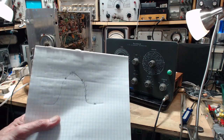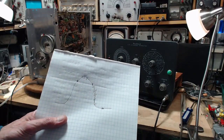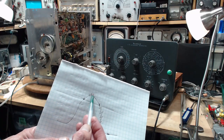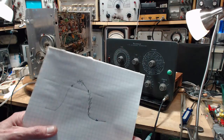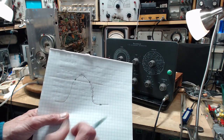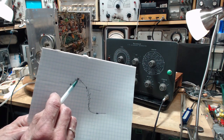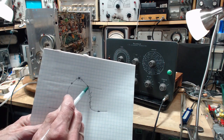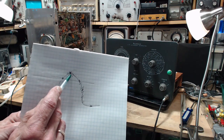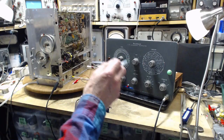I tried to put a marker there, knowing that this guy has a feature to solve this problem. With the extra circuit in it, instead of using RF interference, it manages to place an audio pip at the right point in the sweep display. Using an audio frequency, instead of getting something fuzzy, you get a very, very sharp pip. And if you move it down the side, it's going to look just like this. You're going to know for sure, by knowing the frequency of the marker generator — maybe using a frequency counter — exactly what these are. Can't do it without this special added circuit.